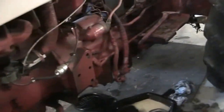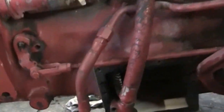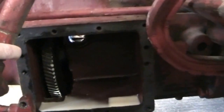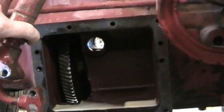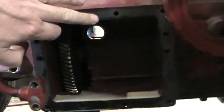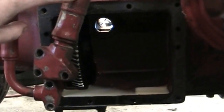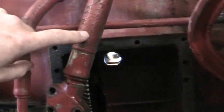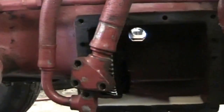On the left-hand side is the pump housing — this is where the pump came out of. There's the gear that's attached to the engine, and you can see all the way through to the filter bay. I just took the flange bolts out and detached the equipment hydraulics and the power steering hydraulics from it.